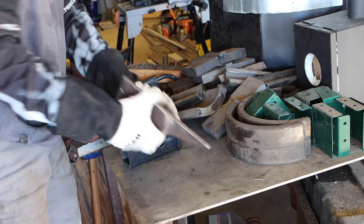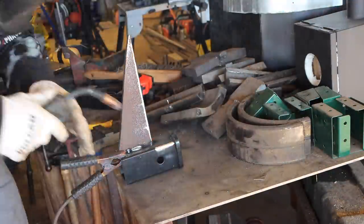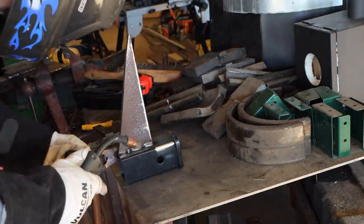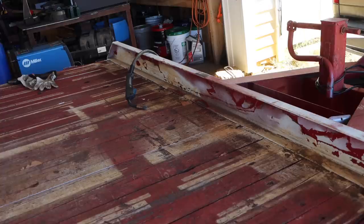Let's make a way to mount this winch to the trailer. So you've probably figured out this system is centered around this 2-inch hitch receiver. This is a great material to use for things like this because it's mass-produced, making it cheap, it's strong, and it's readily available. I mean, you can buy it at Walmart. With a hitch mounted to a 2-inch bar, anything I want to attach it to, I just need a piece of this receiver tube.